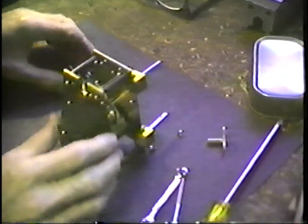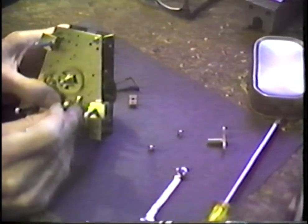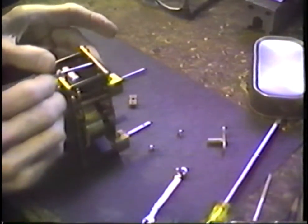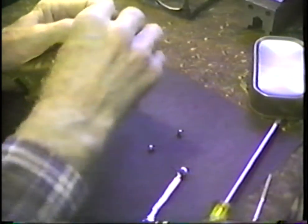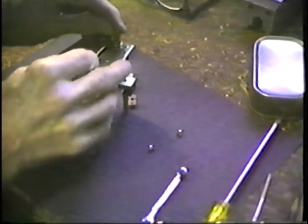All right, let's go together with the escapement. I'd like for that train to stop turning before I start putting the escapement together. Be sure we let off about a tenth of a turn of mainspring there. Go back on the escapement anchor. We recall from right up front that we decided that we needed a visual position of this bridge to be just above the edge of the plate. I've got a problem of locating that pivot hole there.